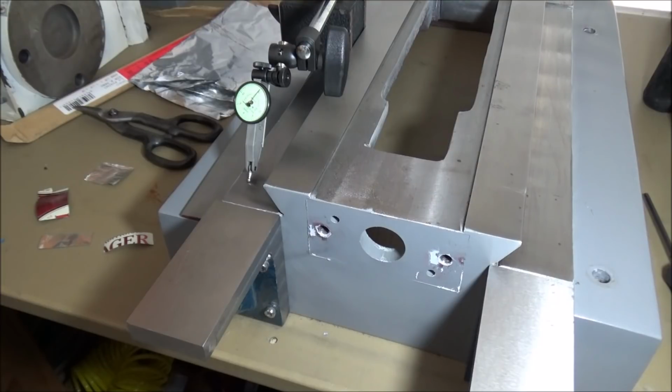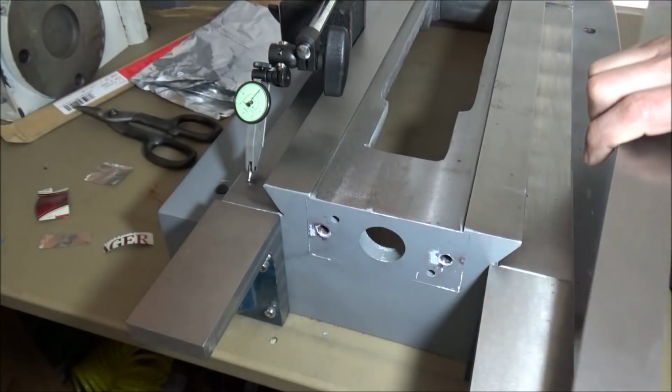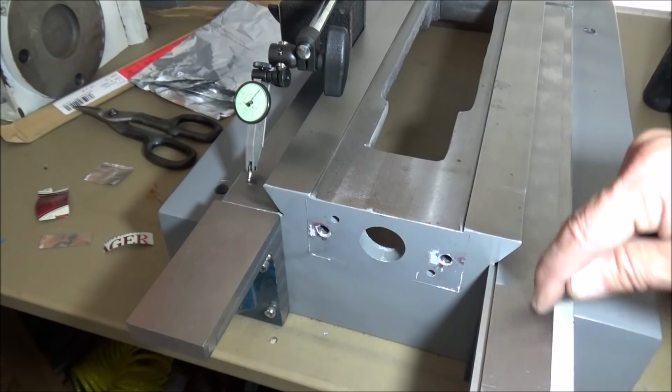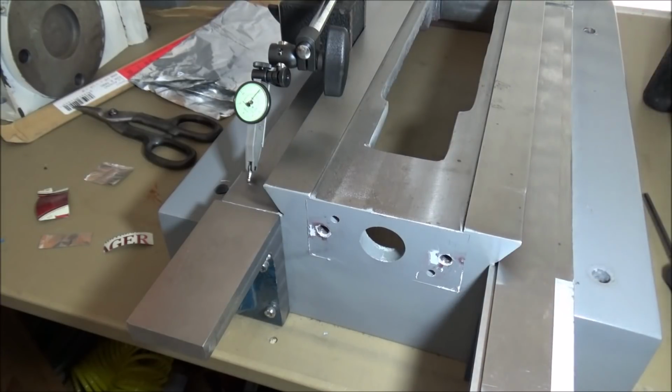I guess that'll wrap up this video. In the next video we will work on probably boring all the holes in the datums. I want to do that first before I machine these datums down to 1 1/8 inches. And then they'll go just like so. After I machine it to 1 1/8 inches, it'll just kind of bolt down. So we'll do that in the next video. We'll start working on boring the holes in the datums.